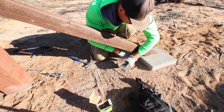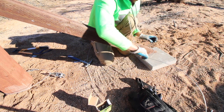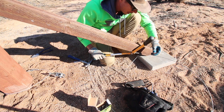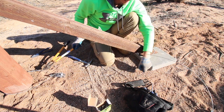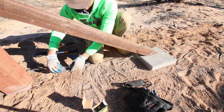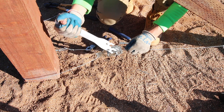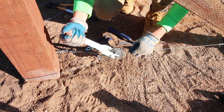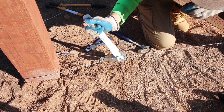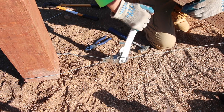There we go — doing our tight coils to finish it off. As I said, this wire is strong but not easy to work with. Normally there's a way of spinning the wire back and breaking it off but it's just not working for me today. We snip the end off, it goes right into the wire strainer, we've got some tension on the wire and as I tighten this up it's going to get tighter as those knots start to tighten up.